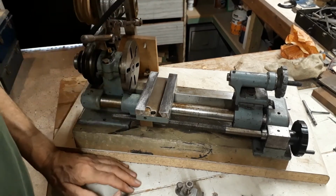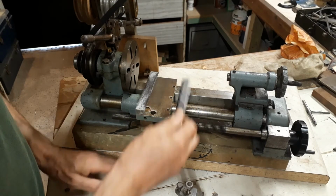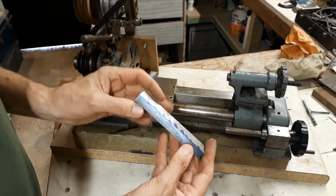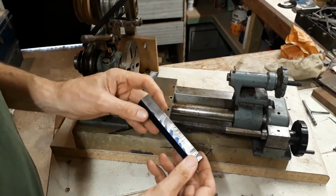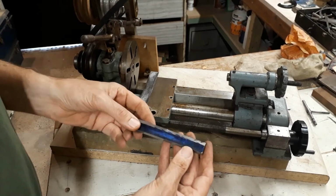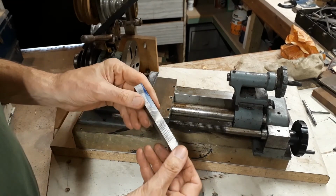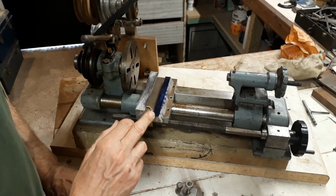And so I'm going to have to take that over to the shaping machine to modify that. This needs a little bit of thought because this is cold drawn mild steel, and by its very nature it has inbuilt stresses. And so what you find is that if you cut a piece of stock and remove material from one side, when you remove the clamping forces, you'll find you end up with a bend in it. And so what we need to do is approach the finished size with roughing cuts, preferably removing material from both sides, and then leave a finishing cut at the end just to make sure that things are straight. So we're going to have a look at the shaping machine and see how I propose to hold this.